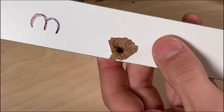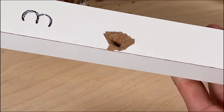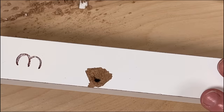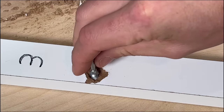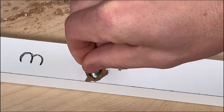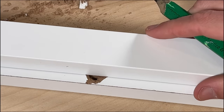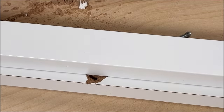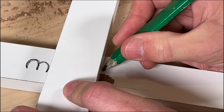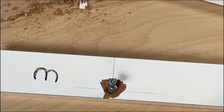Once you get all the loose MDF separated away — and yes, it does need to get a little worse before it gets better — cut away anything that's bubbled up, as that indicates loose material. Then mark the center point. It's critical to keep the exact location of the original hole, so mark crosshairs that you can reference after adding new material.